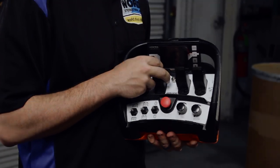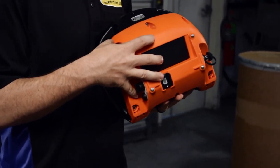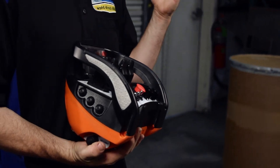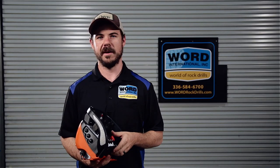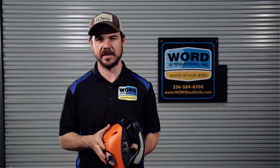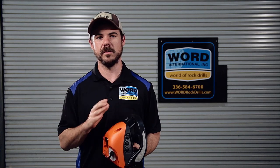You'll be able to see all of that on your display screen. One of the nice features about our radio remote is that instead of all of the programming being based inside the radio itself, we base everything off of the EEPROM system, which is kind of like a little SD card you put onto the back of the radio. So say for instance, if one of your paddles breaks out in the field and you have to be drilling that day, just take out your EEPROM, give us a call, we'll ship you a radio remote, and you install this EEPROM with that radio we send you, and you're up and drilling the very next day. That could go for anything — say you bust your display screen or split the entire radio in half somehow, just take out the EEPROM, we'll send you another radio, and you can install it on that. You can either purchase that radio we sent you, or you can rent it and send back the damaged radio and we can repair it in the meantime — so you don't lose a day of drilling.